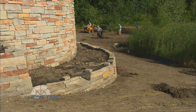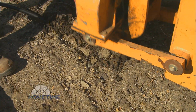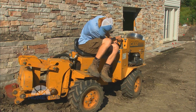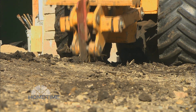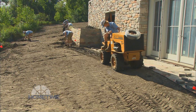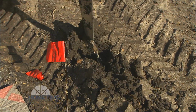We'll start with the lateral lines first. Lateral lines are the head lines, where the heads run. So if there's five heads on a zone, we'll pull all five heads first. To pull the line, you're using a vibratory plow. Correct. What it does is it puts a blade in the ground and it pulls the pipe underneath the ground. It's less intrusive, especially if it's grass. Obviously, this yard is dirt.